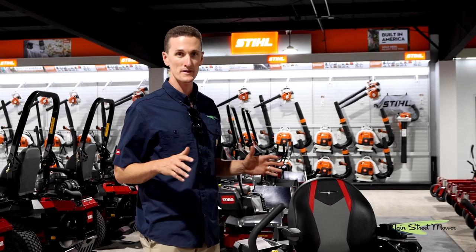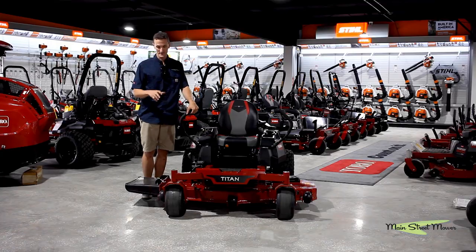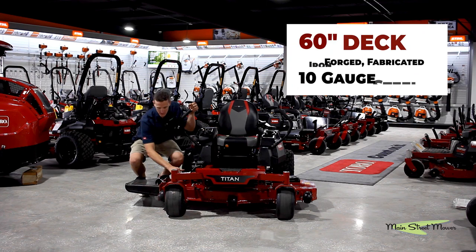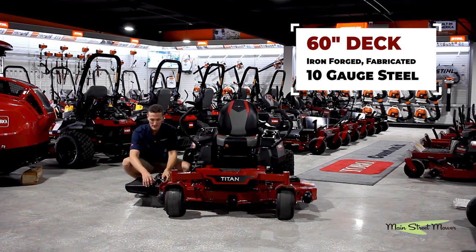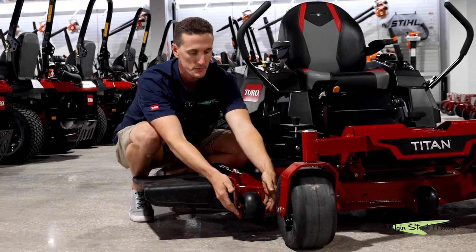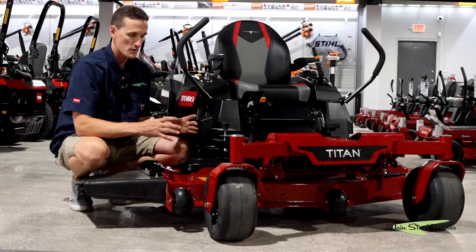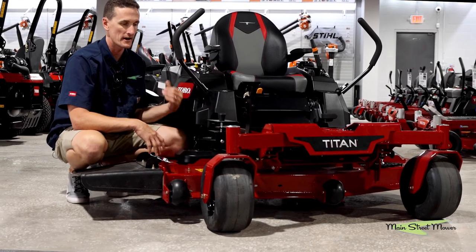Probably most importantly, the most expensive thing if it were to fail on a mower would be the deck, and this deck is built a lot more heavy-duty. It is made out of 10 gauge steel, it has a nice bull nose along the front edge, and a lot of the reinforcing brackets. The anti-scalp wheels are double hung, they have multiple positions, and the spindles where you mount your blades are much larger, heavier duty, thicker aluminum spindles than on a Time Cutter.